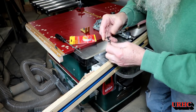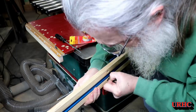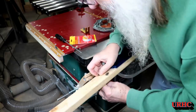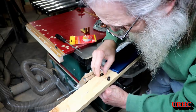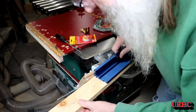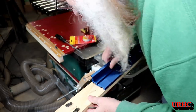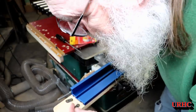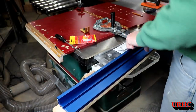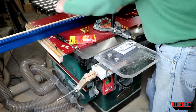The holes I drilled for the screw heads are really tight after a couple of coats of polyurethane, but just had to push them a little bit. Some button head screws go in from the front with a little washer under them, and then the T-track nuts go on the back and slide right into the Kreg extrusion. I put one every foot — about 10 of them — so it's bolted on there good. It's just a sacrificial board so I can make a new one if I have to — just a piece of plywood that takes half an hour to make.